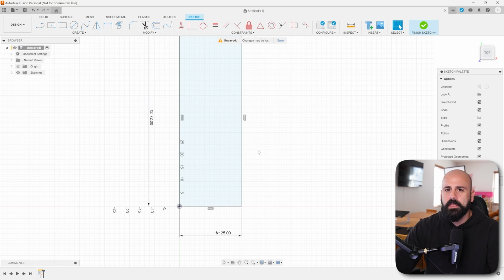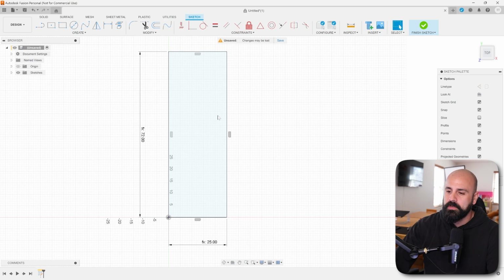So part of this, and again, it will make sense later, is I'm going to have a front and a back lip for some 1/2-inch plywood just to be the front of the cubbies that I'll have for just the offcuts. And then on the other side, I'll have another lip, and this will allow for some of the sheet goods to sit at an angle so they just don't fall off the cart. So I'm going to build those in now.